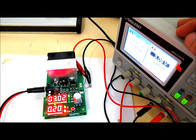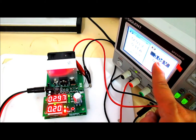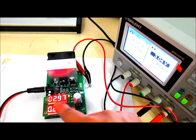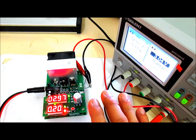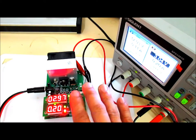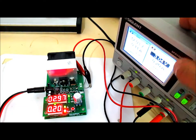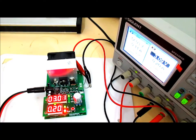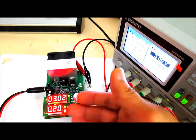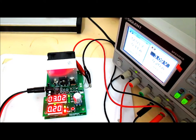We're just above 3 volts — 3.09V on the supply, 3.02V on the load. Continuing to dial down: the power supply sits at 3.04V while the load detects it's below 3 volts and sounds an alarm. Importantly, the load continues to run in Function 1. Increasing the source voltage back above 3 volts causes it to recover and continue running — that's Function 1 demonstrated.